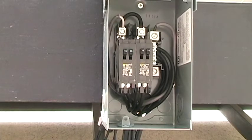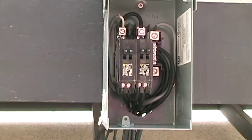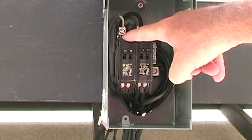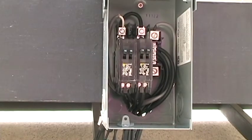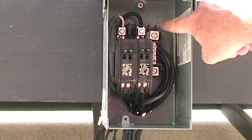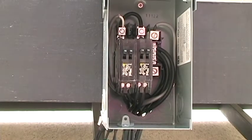By putting all four panels on the same positive bus output, that puts the four panels in parallel, thereby combining them. You'll see there's a jumper that connects the positive bus of the first breaker pair to the second breaker pair, so all four are combined. The negative bus is where all four negative wires terminate, and you have the positive and negative coming out to the pigtail. I'm going to have a pictorial in just a moment that details that a little better.